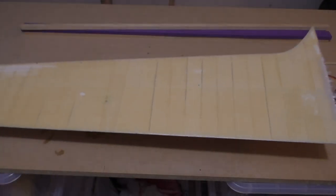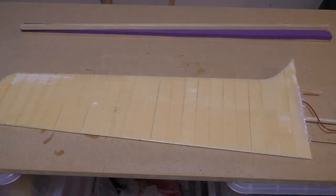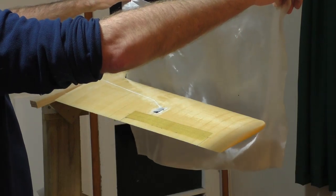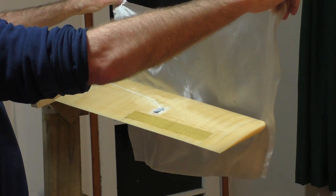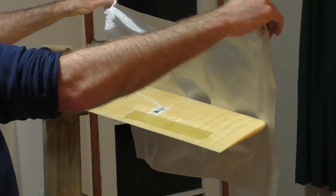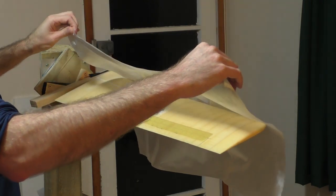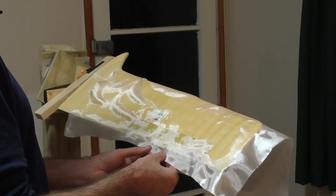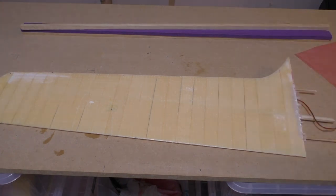That's really annoying, but I think part of the reason might be because yesterday when I tried to put the large piece of glass on, I held it up from the corners like this, just with my hands, one from each corner, and I was just sort of trying to position it like this, and you don't want to pull on it too much, even if the fibers are going along that way nicely. So inevitably what seems to happen is you get it drooping a little bit down like that from the corners, and you can't put it on straight, and then you can't straighten it up once it's stuck on with the resin, and it just gets into a real mess. So I'm thinking maybe I just had too much glass in this area, but I would have thought that the vacuum would still be able to stick it down. Anyway, that's what we got.